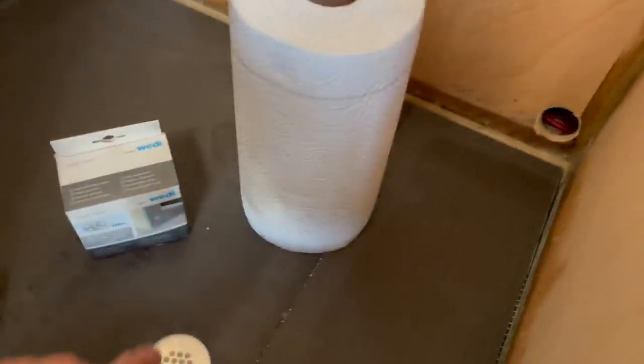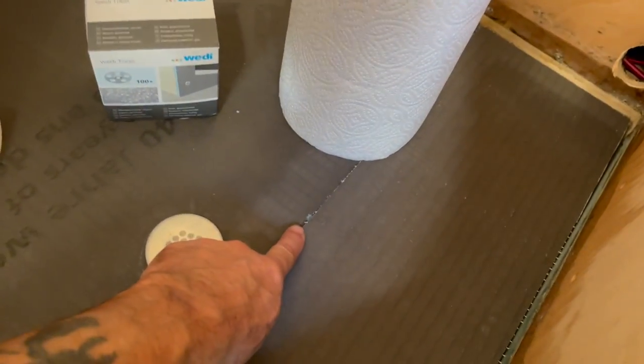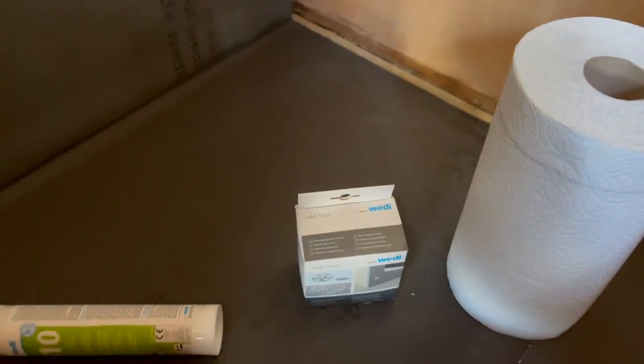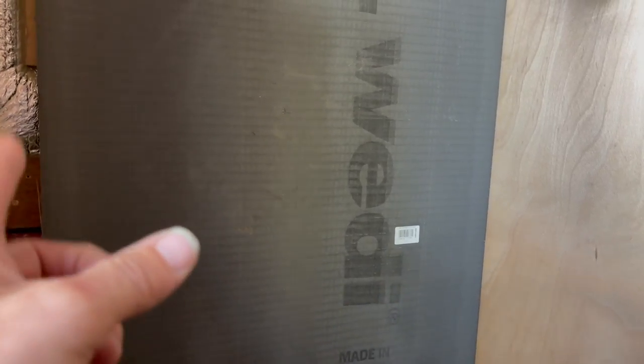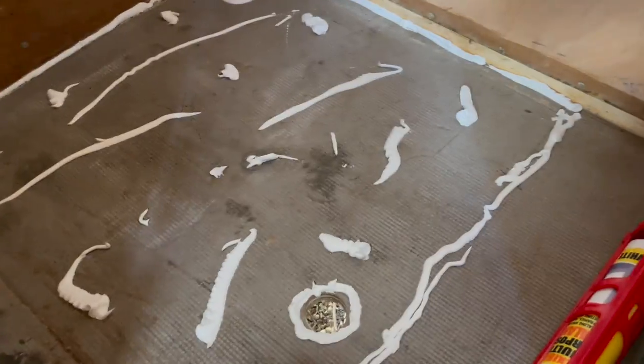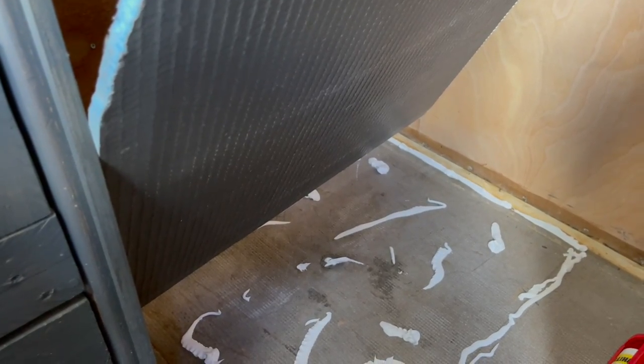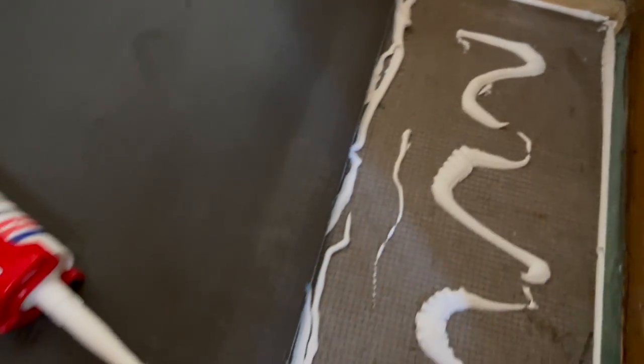I can use that in there. What I'm going to do is lay the silicone down underneath and put a big bead on the join here, then get it in this gap and screw it all down. I've sloshed a bit of silicone around, the board is in — it's all squeezing out the side so I know that's all perfect. Silicone in there, I've done the same here, sliding this bit in. There's one whole tube of silicone in there.